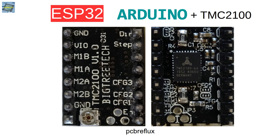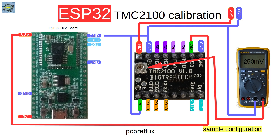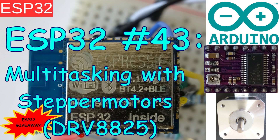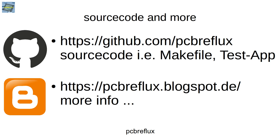Here is a small epitaph for my TMC2100 chips — unfortunately I fried them by applying 24 volts to the reference pin and the magic smoke escaped. Until then there's no alternative stepper driver, so I had to order more chips, which takes up to six weeks to deliver since I ordered from the cheapest seller. I hope you found this interesting and learned something — if so, give me a thumbs up to support my work. Have a nice day, see you next time!